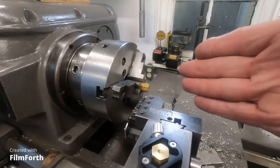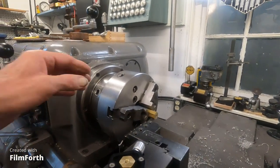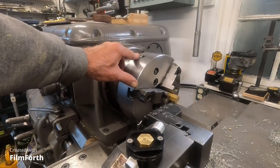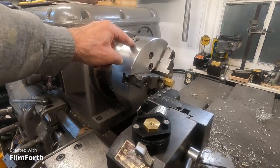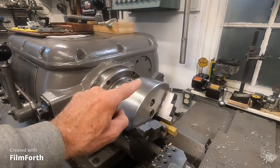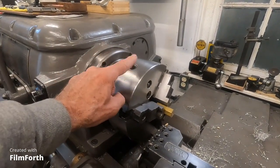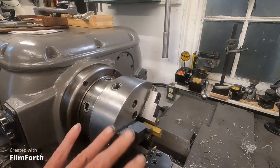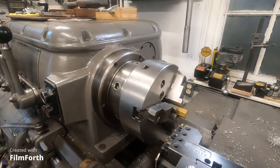And this three-jaw chuck, my eBay special here, it's actually in quite good shape. And it's an older chuck, probably early 1950s, maybe 40s. And I recognize it because the pinions are kind of small. I got another chuck like this, but it's a D13, and it's got large pinions and stuff. And I know this is an older one. These are kind of, you can fudge these and break them. And this one has been used, but not really abused. And it's coming around good.